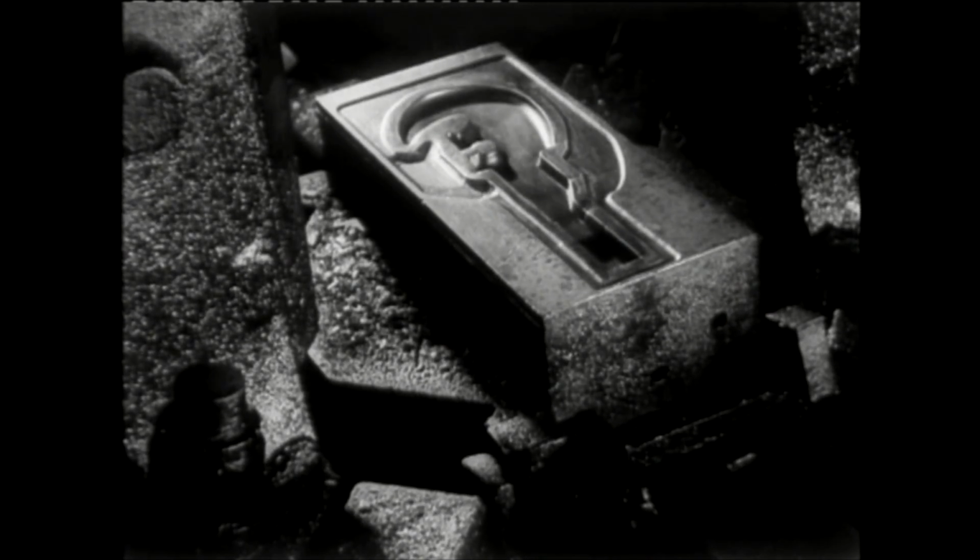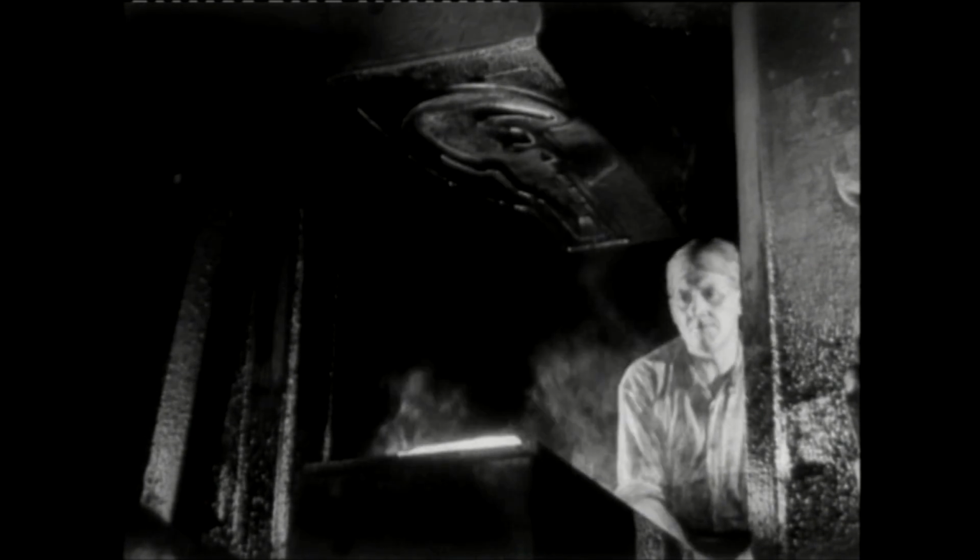The forge is a place where large lumps of metal are heated until white hot and then hammered into shape with huge but nimble mechanical hammers. These hammers incorporate upper and lower dies in the form of the desired shape of the end product. This is a team process that requires skill and awareness, as the white hot billet is swiftly swung around the forge and placed on the lower die. This is a time-critical activity to get the hot metal formed before it is cooled.